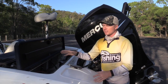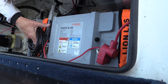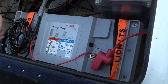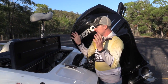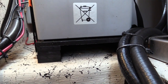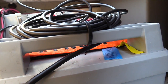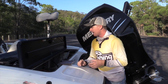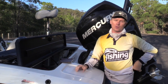The cool thing about having the batteries in one unit is that lithium batteries I've had before would run as two 12-volt ones that you had to put into series, and they would also need a control box and their own separate charger. But this unit here mounts straight in the back of the bass boat — we've just had to build a little shelf to fit the width of it. It's IP67 waterproof, so if I do have an accident and it comes under water, it's safe and protected. I've strapped it in with two strong webbing straps which keep it locked in place.